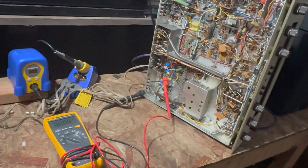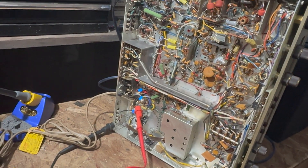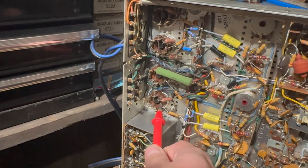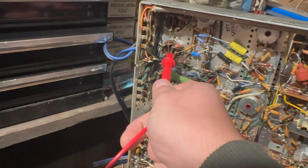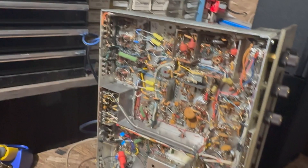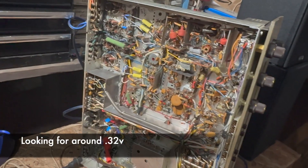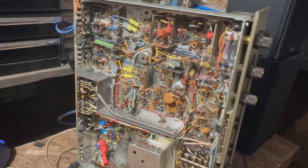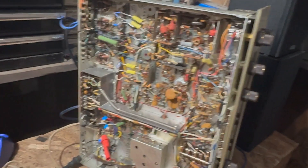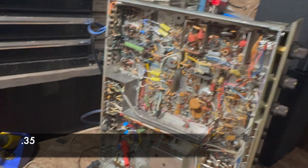The second thing I'm going to do now is check the voltage on the cathodes. I have these cathode resistors put in — one over there and one up there. I'll check the voltage there and see what we're at. I think it was 0.030-something is roughly what we want. A little less would be okay, maybe a little more. But we don't want them higher than 0.035 on any one of those tubes.